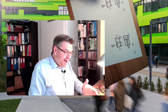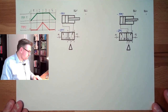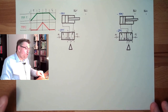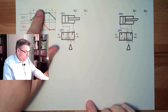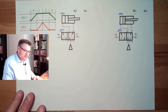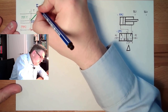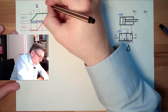The task is still the same. We have two cylinders, MM1 and MM2, and they shall move in this pattern. The goal in cascaded control is that we subdivide this control into parts where all situations are unique. In this case we have to divide into two parts — one part on the left-hand side and one on the right-hand side. In both parts, every combination is present and not twice. This is the most important thing: it's not twice. So this here is part number one, and this here is part number two.